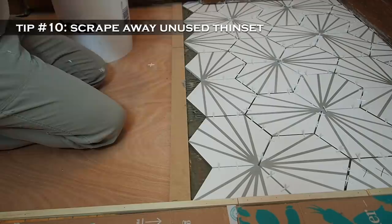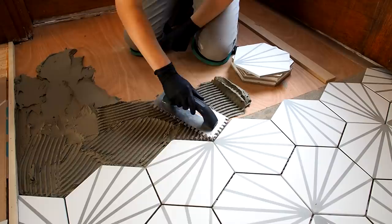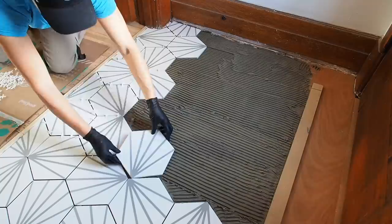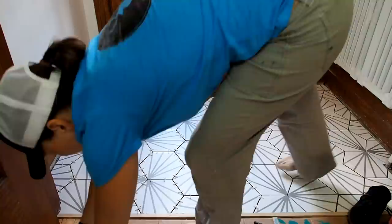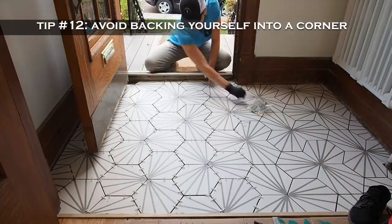Because I'm working in sections, I let this first section dry for 24 hours so I could walk on it the next day and lay my next section. The next day I mixed up a new batch of thinset and applied it, then using my system of piles I dropped the tiles in place one by one, moving them back and forth slightly in the bed of mortar for good adhesion. In case you're wondering about backbuttering — from the research I've done, you don't need to backbutter small to medium tiles like these, but it is recommended for large tiles, and that's tip number eleven. Once I reached my temporary ledger I simply removed it and filled the remaining section. Eventually I had to open the door and work from the outside — tip number twelve: don't back yourself into a corner; always finish at the edge of a room or a doorway.